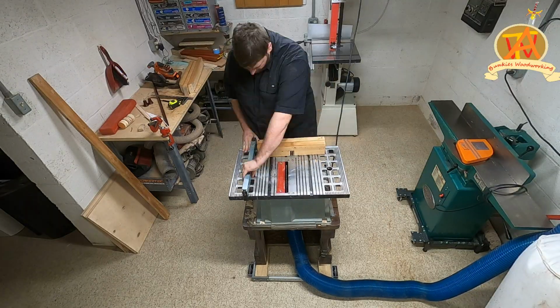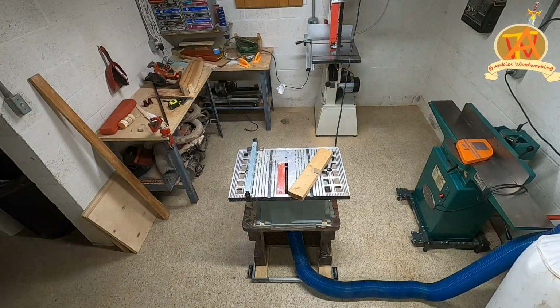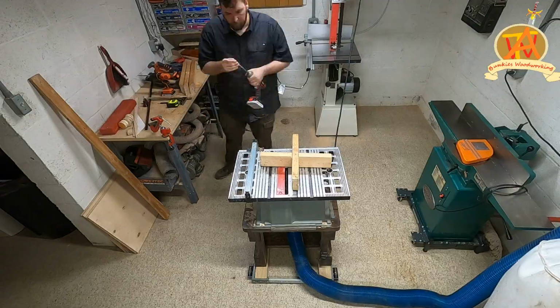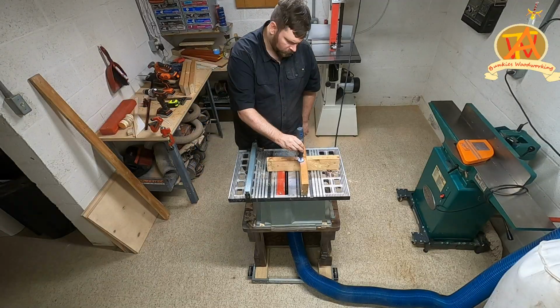Once the grooves for the half lap joint are cut, you have to clean up the area with a chisel for a plumb fit. After cleaning up the area, I did a dry fit before drilling and screwing the boards together. The screw I used ended up going a little bit too far into the hole, so I got out the Dremel tool in order to cut off the end of the screw.